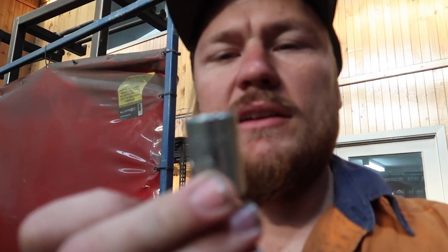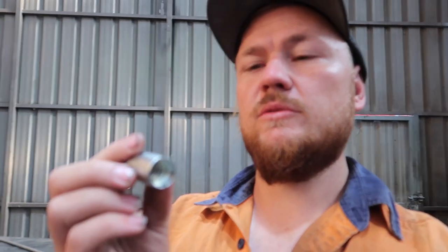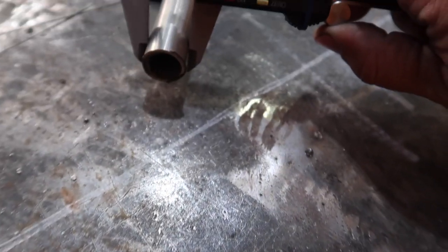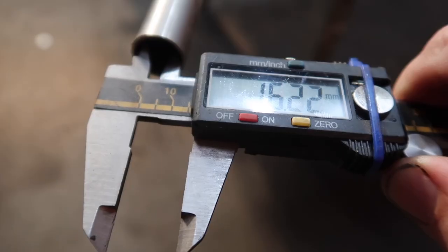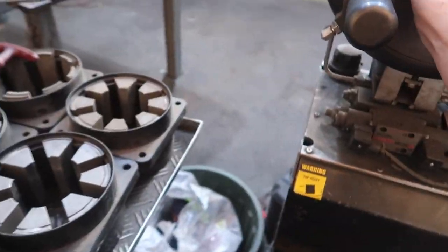What we're going to do now is get a little bit of adjustability. I'll crimp one side with the hydraulic crimper so it can be a sliding fit and swivel when needed. Here is a hydraulic crimp — this is an FNPO4, so it's for a quarter-inch hose. You put the hose through there and the little crimps squash it down tight for hydraulic pressure. It's made out of steel, so it seems a good fit to just put a bit of tube in there and get it to a size you want. So we're going to put this end in the crimper and squash it down to 16.2mm so it can go inside that.